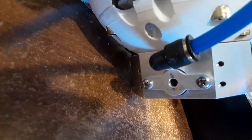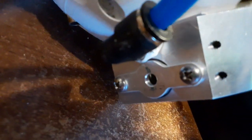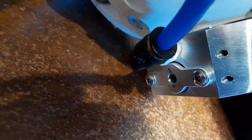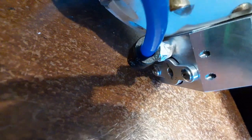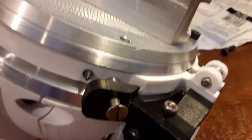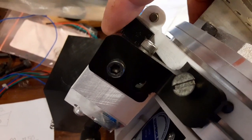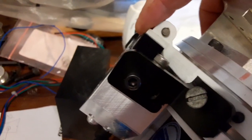I've got these plates on the bottom and they allow the air to come out of the bottom of the piston so it can go down - if there was no place for the air to go the piston wouldn't move down. There's a hole in the bottom too to help it. There's a spring inside of there, and there's a hollow spot inside that piston - the spring rides inside the piston against that bottom piece and that's what pushes it back up after it expels the air. This side isn't releasing like I want it to - there's probably a little bind in there. This side over here is working good.